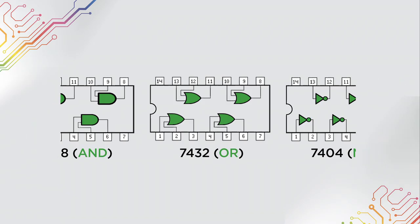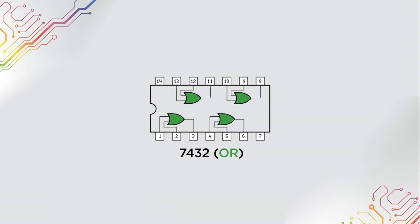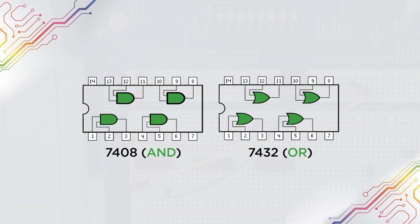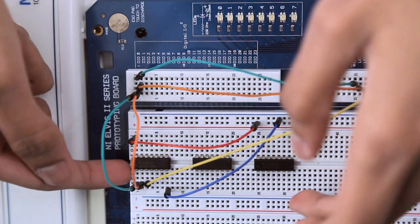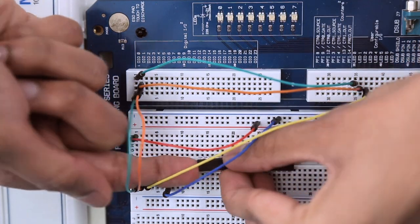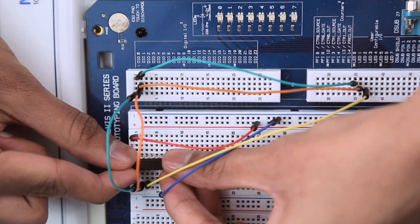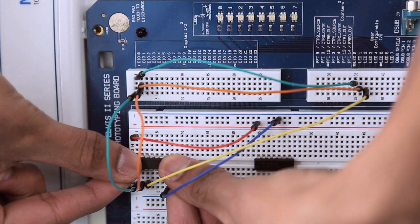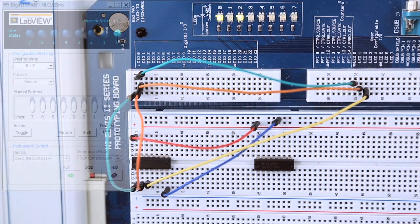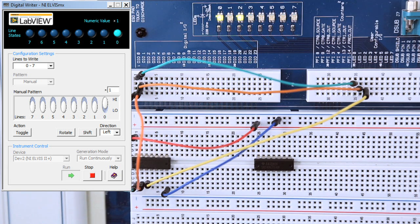This last example will demonstrate the OR chip. The pin configuration of the AND and OR chips are the same, so we can switch our AND with the OR chip using the current wiring. This means that our same inputs would be processed using a different type of logic. So if at least one of the inputs are on — for example DI0 — LED2 should come on. This type of logic means LED2 will also turn on if both inputs are on.